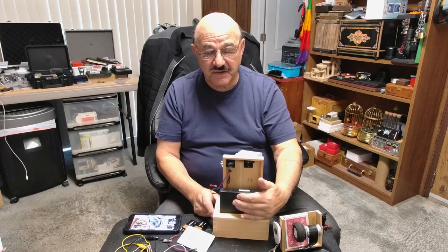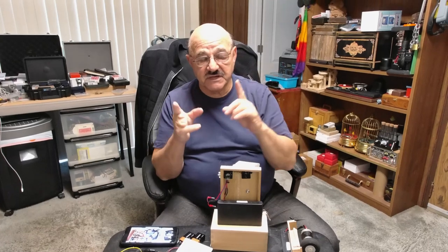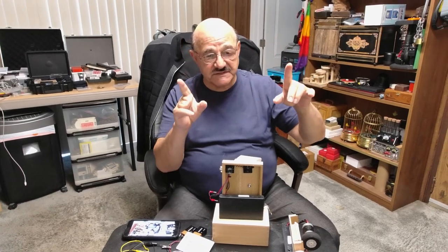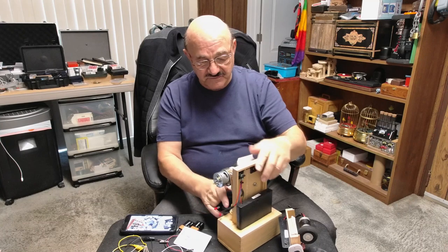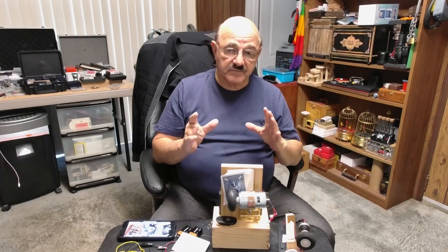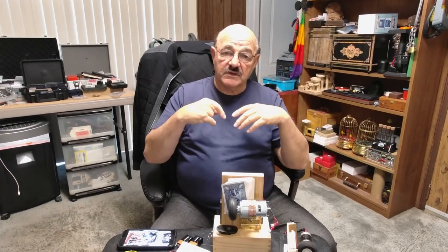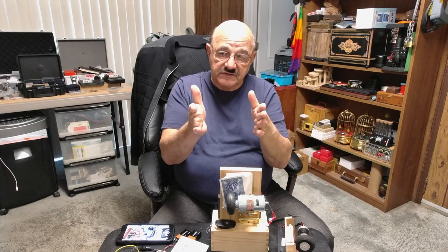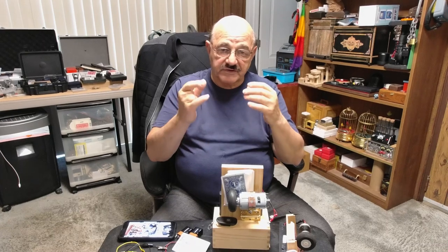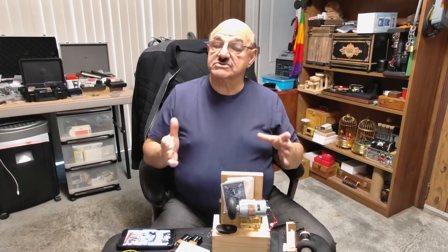If you take this power pack and add a second power pack — Velcro it here, then take the plus and the minus, solder them together with a little shrink wrap — that's called wiring it in series. If you wire power packs in parallel instead, you're going to get your 12 volts but double the amperage. We don't want that. We want to wire in series so we're doubling the voltage — taking the voltage and doubling it.